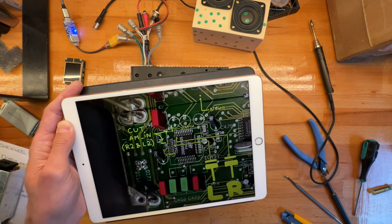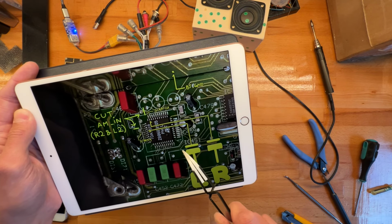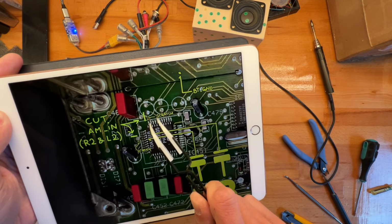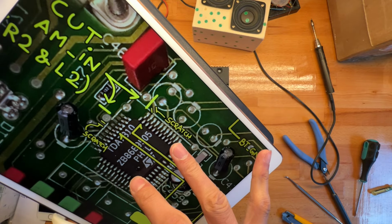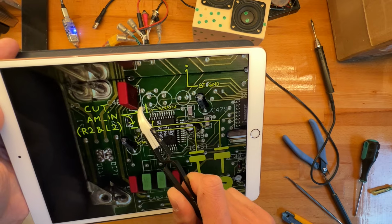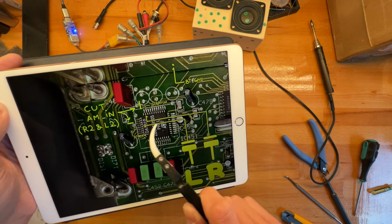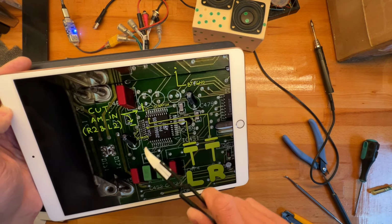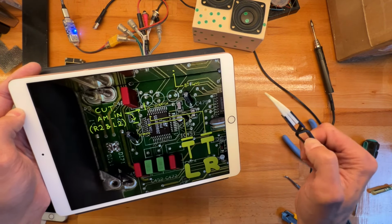So definitely way better. And what you have to do is decouple these, block the DC, because these traces, these channels from the mixer, you could check the data sheet of the TDA7310. So these pins are part of the signal path, and that stays at about, I think it was 7 volts above ground, right? So all the sound is an AC, right? Definitely, that is overlapped onto a 7-volt bias.